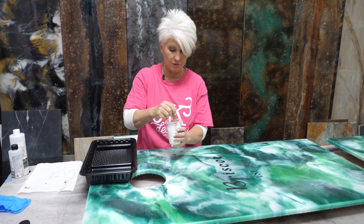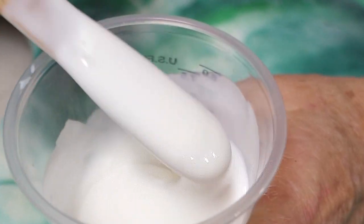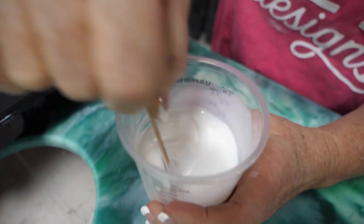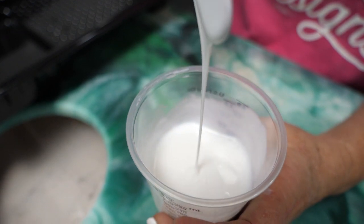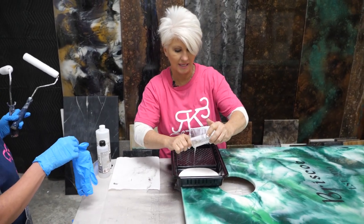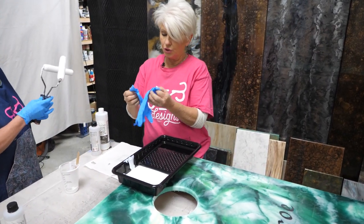Let me show you another little thing I've noticed. Look at how thick this material is before I put the water in — as I lift, see the little mounds it's creating when it hits the surface. Now see what it looks like after we add a cap full of water. Make sure you mix it really well, scraping your edges. When I lift the stick, the little mounds now flatten out a lot faster — that's how I tell if it's the consistency I need. I try not to mix up more than about 10 or 12 ounces at a time.